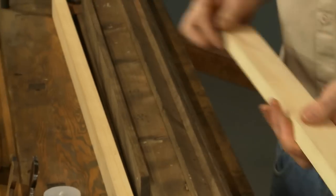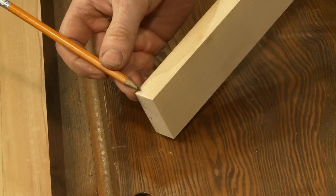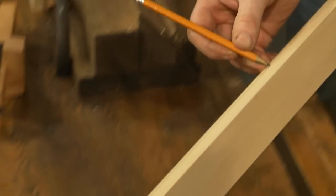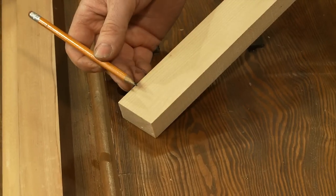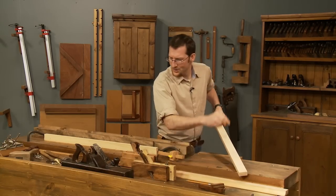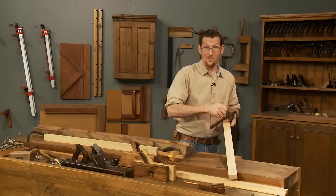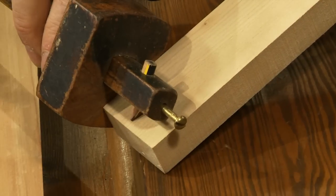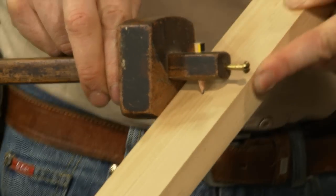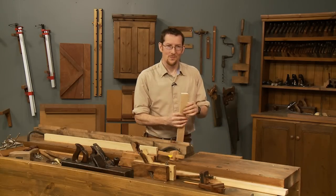Let's mark out the wood. I'm going to show you two different ways of marking out. The first way is to use your finger as a gauge, set to about three sixteenths, and run it all the way down the wood. The second line is about three quarters of an inch from this edge — I could use my fingers for that but it's a bit of a stretch, so I prefer to use a pencil gauge set to about three quarters of an inch. Make sure it's nipped up; if it moves you end up with a wiggly line. Hold it against the wood and just run a line.